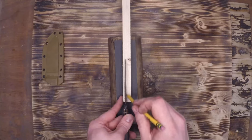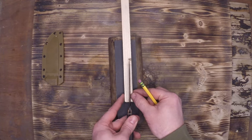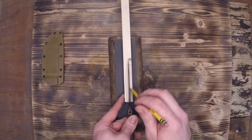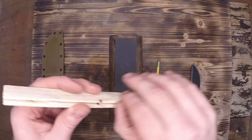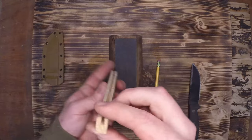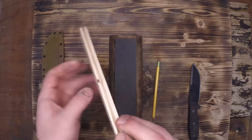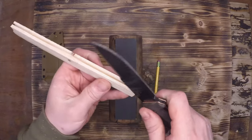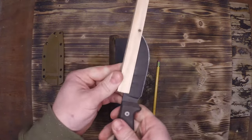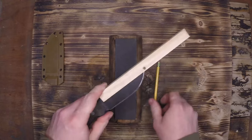This doesn't have to be very accurate — it's just a starting point from which to work into final dimensions. I cut it to the appropriate width and then ran a groove down the center with a table saw to see if it would fit the spine on the first try. One side was a little too thick, so I took a couple of passes on the hand plane to bring it in, but it does snap right into the blade with just a single pass on the table saw.